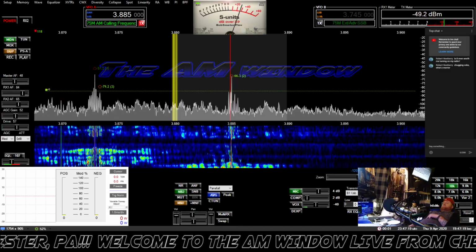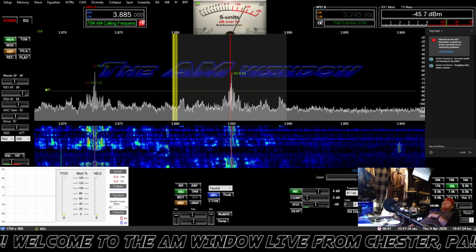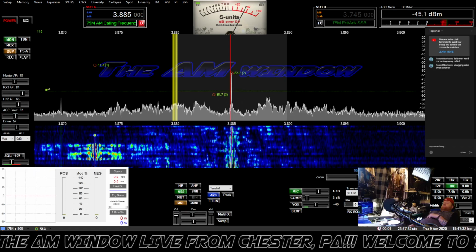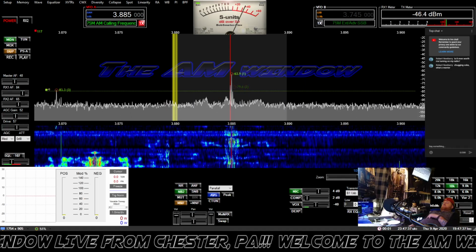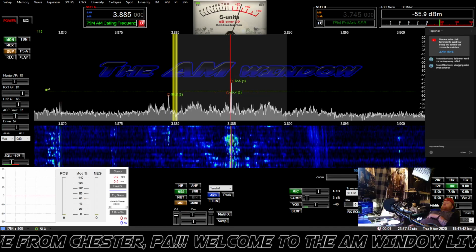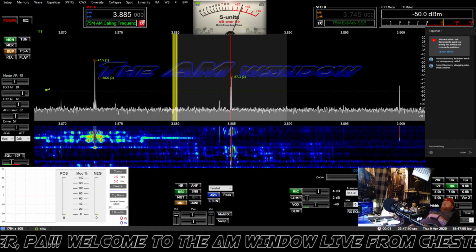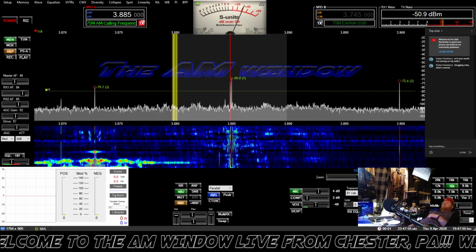Yeah, it's just one transformer, and the secondary has taps on the winding for low voltage, and then in many of the Rangers they have a fixed bias supply. There's another set of taps for the bias. But using it that way is very capable of handling the load. And typically the 6146, you'd load it up to about 60 or 70 mils. When you drop the plate voltage, it just dovetails right into exciter class.